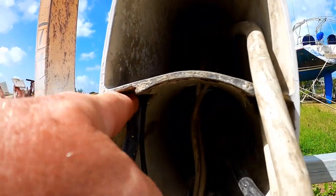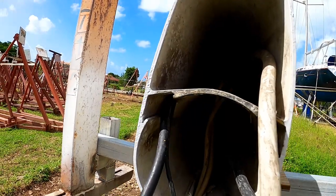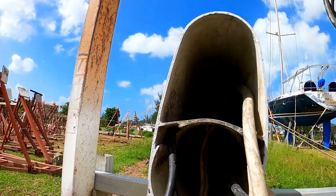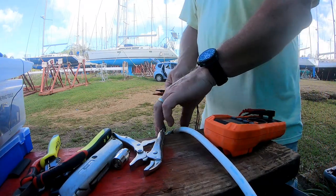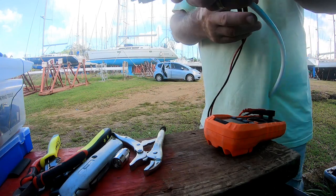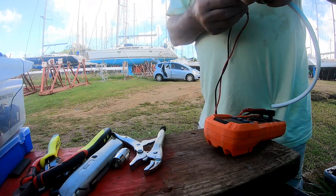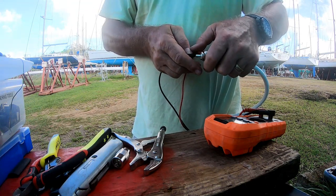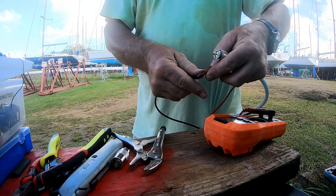You can see what's going on — this is going into this little tiny channel and there's no moving it. That's our VHF antenna, so I don't think that's getting replaced. I've got to make sure I'm putting ferrules on the one for the VHF antenna. One of the things you have to do is tone it out — make sure there's no connectivity. And there's not; if you touch these together you get a small tone.